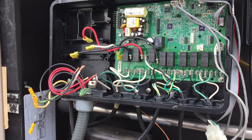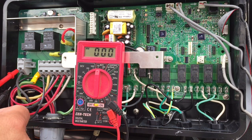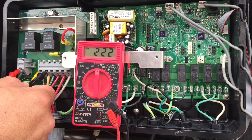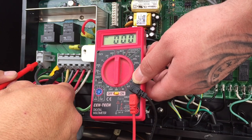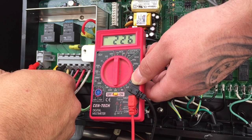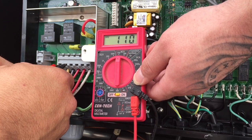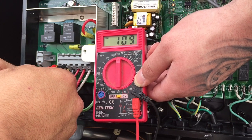I'm going to install the new one now. Okay, I'm back — the new board is installed. I wanted to show you that the leads going to the heater are now getting 220 volts. Before, I wasn't getting anything — I was getting zero. Both hot legs of the heater now are showing right around 225 volts. Leg to ground on one side is 114; leg to ground on the other side is about 110, and that's about what we were getting on the other one, which would explain why the heater was maintaining 96 degrees.